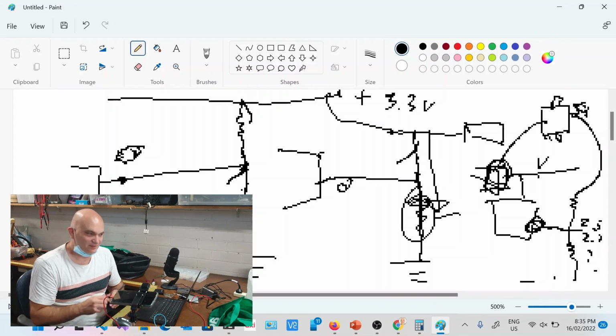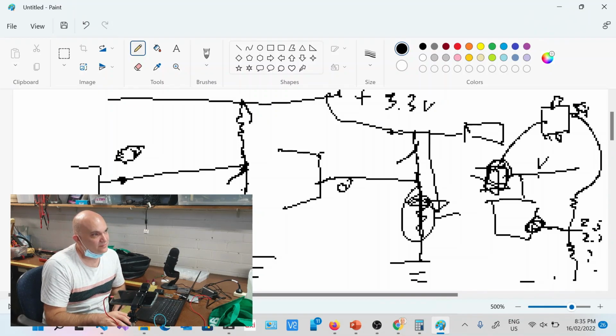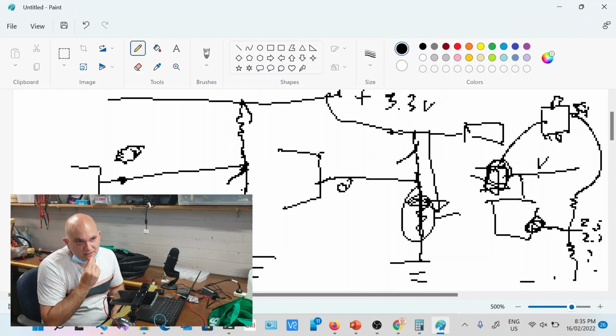Okay, so what sort of values would you have for those resistors? It's important they've got to be pretty high values. I'd say hundreds of K. Maybe 100K each. It depends on your leakage current and ports. I'm trying to think what values we used. I think we used 200K. I've got it written down.